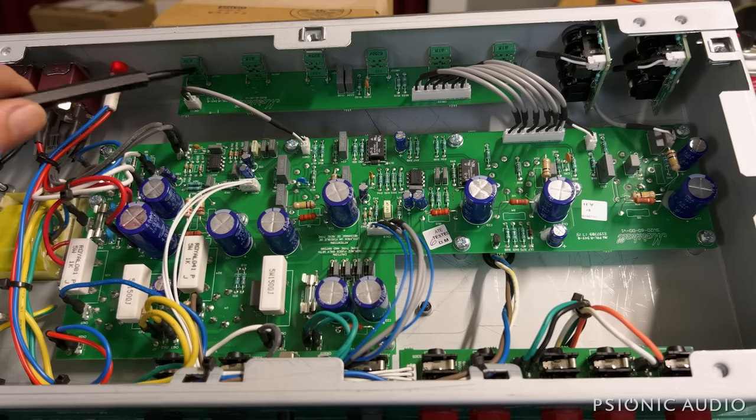I would expect that once you got the balance right between the normal and the high treble, and if I reverse the jumpering there, it'll be even better. This would be a good pedal platform for practice. If I go into the normal, then jumper over to the bright, I'm going to get a little more oomph out of the normal channel and a little less bright, which gives a little finer control over blending them for cleans.